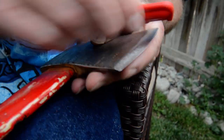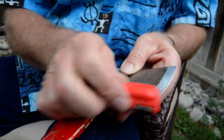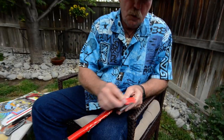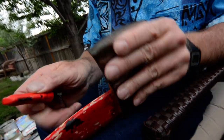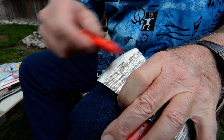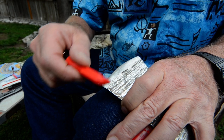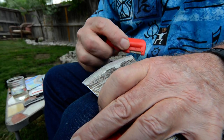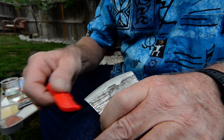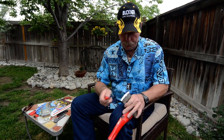Okay, so let's get to work. Go right on around, right off that point. I'm going to flip it over and come back this way. Just don't push too hard on it — let it work, don't make it work. Go right on across the blade like this, and I'll slow down a little bit on this side so you can see better what I'm doing. Come back this way, turn it over and go this way. Don't tip it down trying to get to the cutting edge — keep it up at about a 12-degree bevel. You can roll it over and go this direction toward that point, set it down and go this way, all the way across like that.